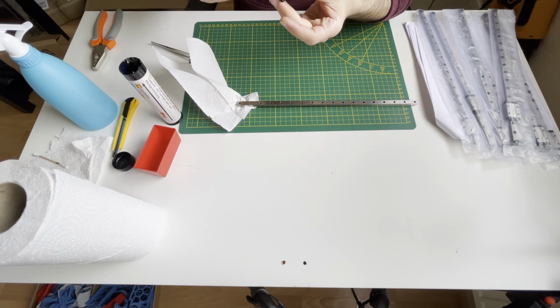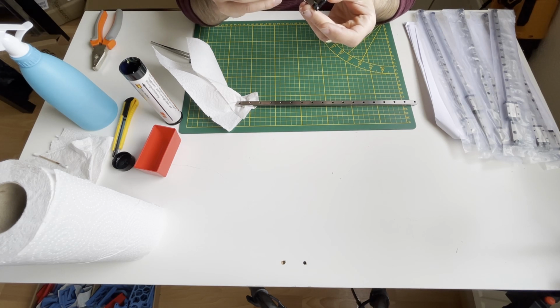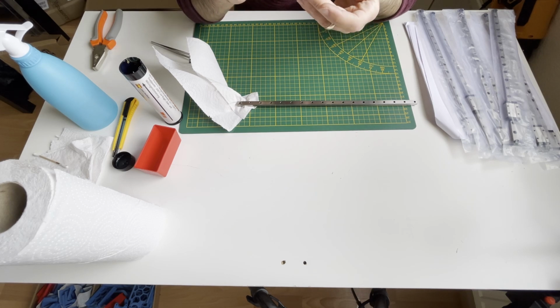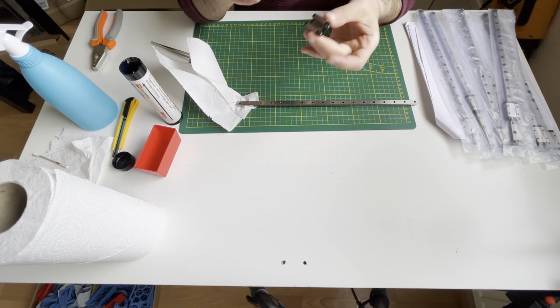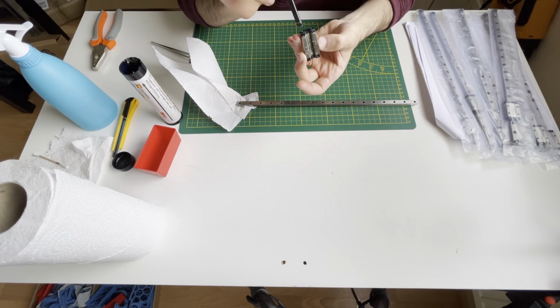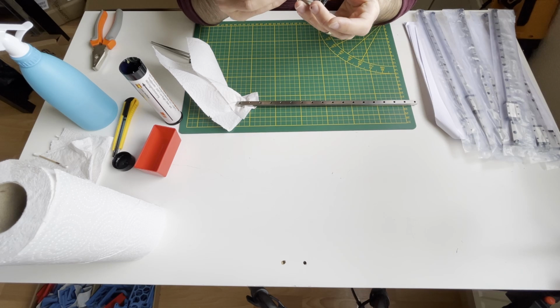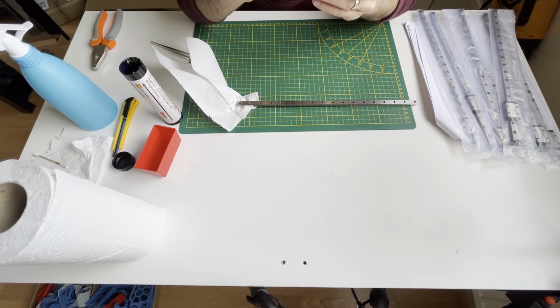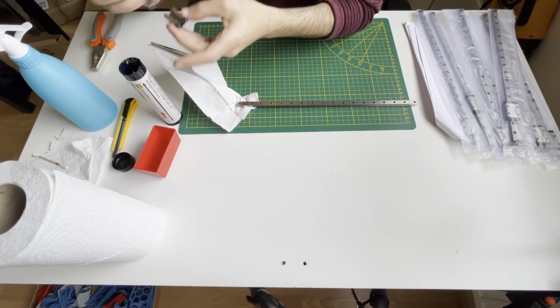You know, this is the second attempt I'm building the Voron. 1 or 1.5 years ago I was building a Voron 2.1 and I couldn't finish it since I moved to another country and started my life again. In that one I had really cheap Chinese rails, and I disassembled all the carriage, removed all the balls and this wire, etc. I cleaned them separately, filled the empty line in the carriage where the balls are moving with grease, and assembled it again. It was way harder than this one. But since these rails are in good shape, I'm just trying to grease like this. Yeah, and little bits on the middle part. Oh, that's a lot, I guess.